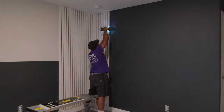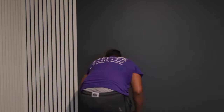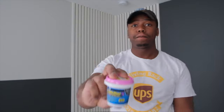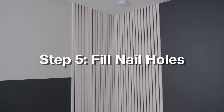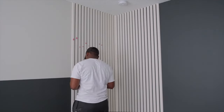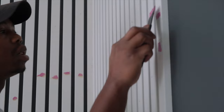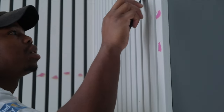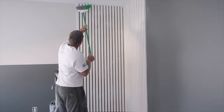One thing to make sure you think about is how the bottom part of the wall slats meets your baseboard — whether you're keeping the baseboard or removing it. This was something I hadn't quite figured out yet, and you'll see in a few minutes how I dealt with that. After nailing in all the wood slats, I used Plastic Wood X from DAP to fill all of the nail holes. This was probably the most tedious part of the entire project. It worked well, but I applied too much on the first pass, which meant I had to sand everything down and created a lot of unnecessary dust.